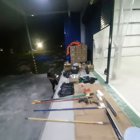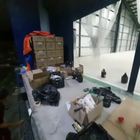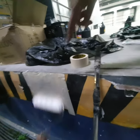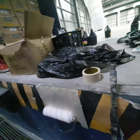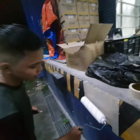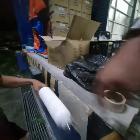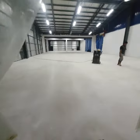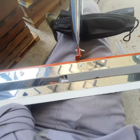So Exy here, what he's doing is taking out the lint of our rollers. As you can see here, he has put masking tape and rolled it out. This will help us also to have lint-free operations. So that makes all the residual lint come out of your rollers, so you won't have a lot of lint when you start priming or coating.